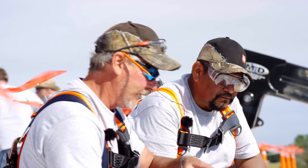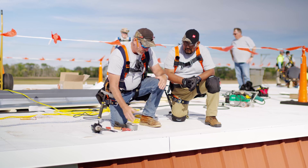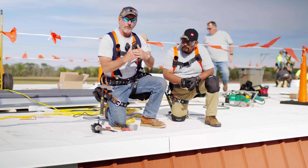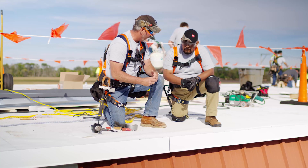Now the big detail to remember is right here. Wherever you start a new piece of metal, this is called a bond breaker — it's kind of a mini expansion joint. We never overlap coated metal like those other ones we could overlap. This one you can't. If you overlap coated metal and you pin it, I guarantee it's going to split right there every 10 feet.